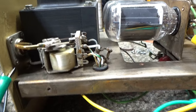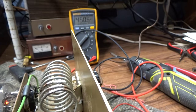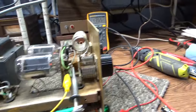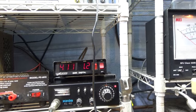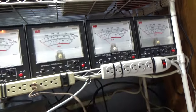So basically: drive goes into the tubes, the tube amplifies it, it goes out into the tank circuit, then from the tank circuit into the relay on the output side, and out to the antenna. On standby, the amplifier is off. I'm showing 1.2 input SWR and putting out four watts from the radio, but on the output side of the amplifier only about a watt and a half is making it into the SWR meter.